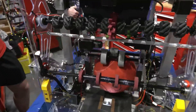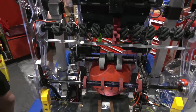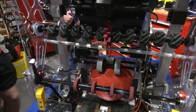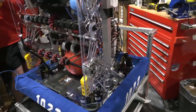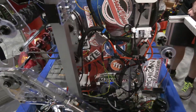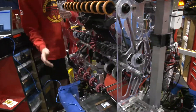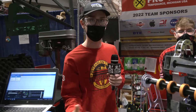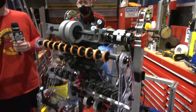When you were packaging your robot, how did you think about needing space for ejecting and also getting the right curve or bend to get the cargo up into your shooter? Curving was a lot of prototyping. We used a lot of 3D printed pieces, a lot of plywood and stuff like that, and we built boxes and fixtures just to test compression with the balls to get it to snake through the way it does. We tried to keep the center of our robot as open as possible because we wanted a straight path through, which makes ejecting the balls a lot easier.